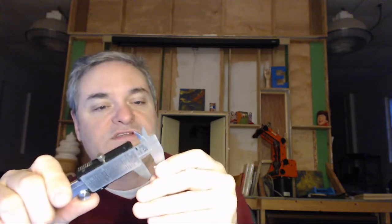All right. So let's get a rough measurement. This is kind of like what I did yesterday with it, that we understand that what we're making here is a part that I'll probably apply a subdivision surface to, just to make the holes round, and that by doing the subdivision surface, our precision modeling will no longer be precision wherever there are things like holes and stuff like that. And so we'll have to then conform those to a higher resolution geometry to get the holes right. So anyway, here's where we're at. That looks like it's a 4 millimeter.